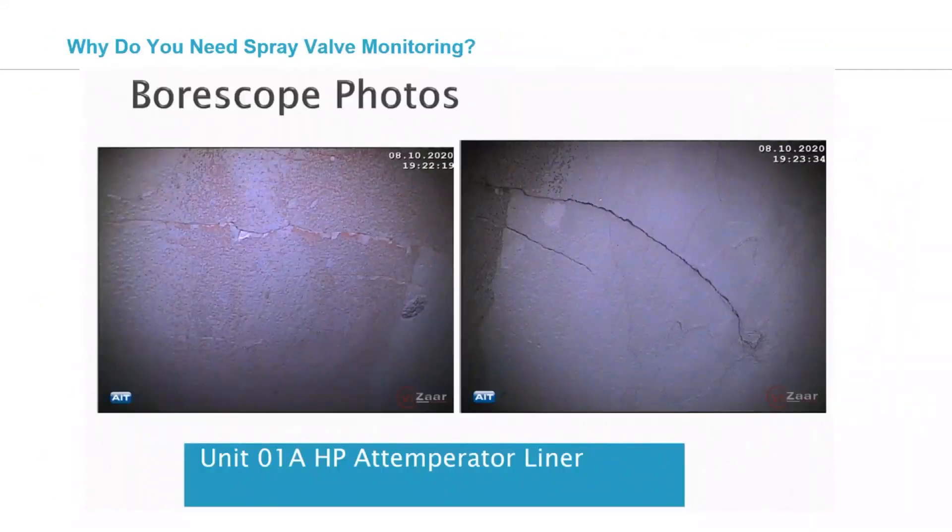Here are a couple of photos of damage found during our internal bore scope. This is not a steam pipe — it is the liner just downstream of the spray nozzles, showing significant cracking immediately downstream of those spray nozzles. You can imagine water dribbling in instead of having a nice spray pattern that can evaporate quickly. When you don't have sufficient steam flow and velocity during startup, shutdown, or low load conditions, water makes contact with the very hot steam pipe and liner and can cause the quenches that develop into cracks pretty quickly.